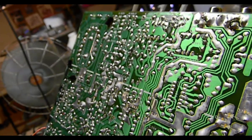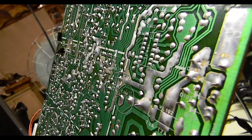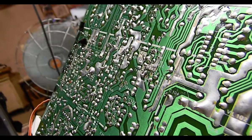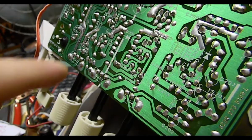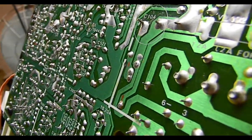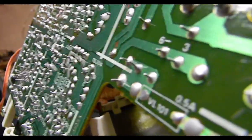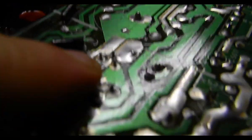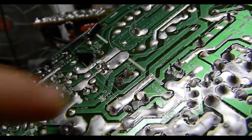I can't believe I went through the effort of making this polarized piece of shit. It was all the circuit making these capacitors sound crappy — all the ones I pulled out test perfectly fine out of circuit, and the ones I put back in the circuit sound like shit. So that's an entire day wasted. It's about 1am, I'm really tired, I've been up since 4 in the morning. But I don't want to go to bed without this working. I'm gonna try tacking up every even slightly questionable solder joint on here, and I'm gonna carefully inspect everything — the slightest little bald spot or crack is getting redone with fresh solder.